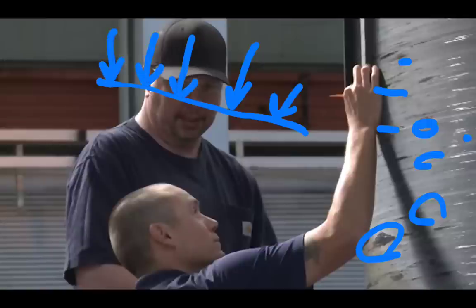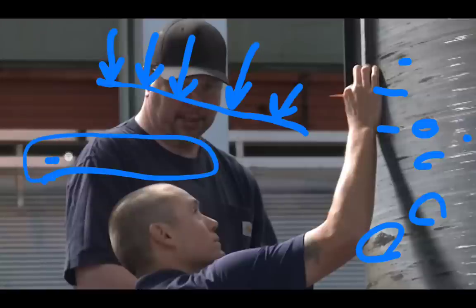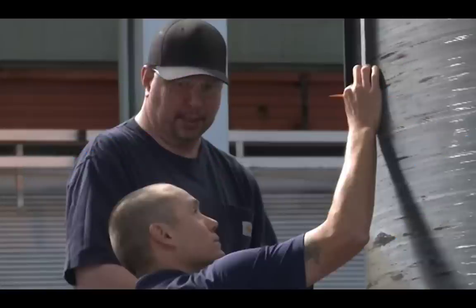I use fiber cement a lot. When fiber cement dries, those little three-quarter-inch microfibers shrink back, pull on the fiberglass members, put them into tension — post-tension cement. I tested this on many walls. I was able to knock one over with my vehicle once, which fractured it abruptly. It resisted to some degree then let go like you'd break a plastic fork — brittle.